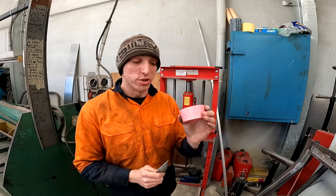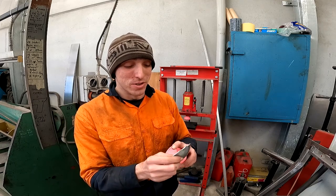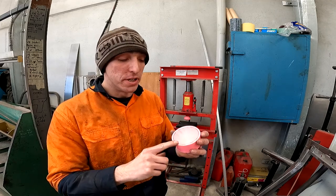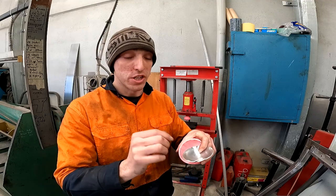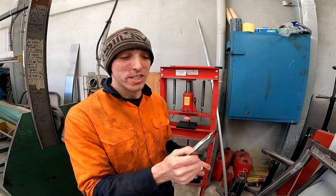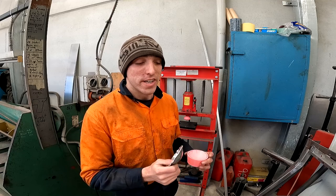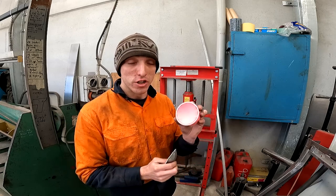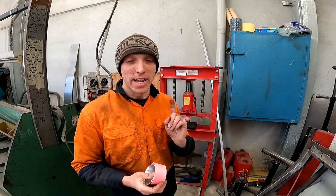I don't actually know whether this wrinkling is avoidable — I'm thinking it probably isn't, because you're trying to push a dome into a flat bit of plate. What I'm thinking is that these dies need to be bigger than the actual piece you need to make, so that the wrinkling hopefully happens on the material you won't end up using. Either that or this is just a completely stupid idea. I'm happy to post all my stupid ideas on the internet for your enjoyment. If you've got any advice please drop a comment below — I'd really appreciate it because I'd love to revisit this and make a better version. If you like this and want to see more 3D printing or fabrication, hit that subscribe button.